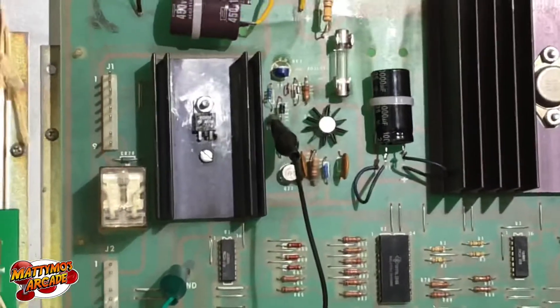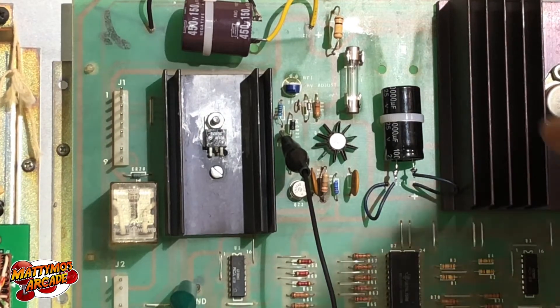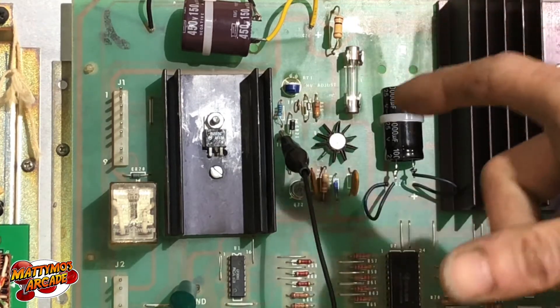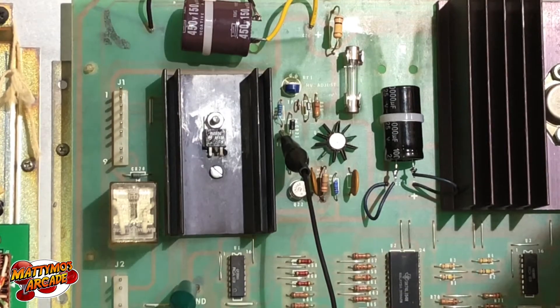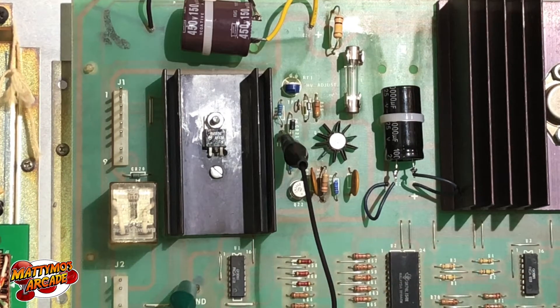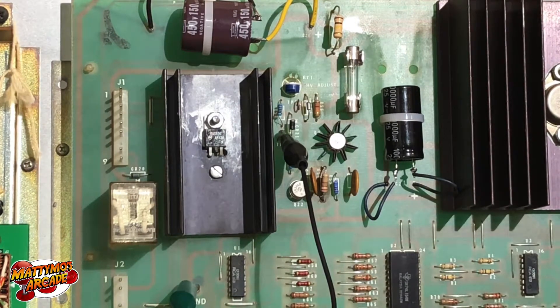When I first started the game, we had no displays and no high voltage to the displays. There's a test point up here — test point four — you hit that one to ground and it should read about 220 to 250 volts. It read fine at about 245. Then we have test point two, which should have read 190 volts, but it was actually the exact same as test point four. When your two voltages match, you're going to have to rebuild the entire high voltage section.